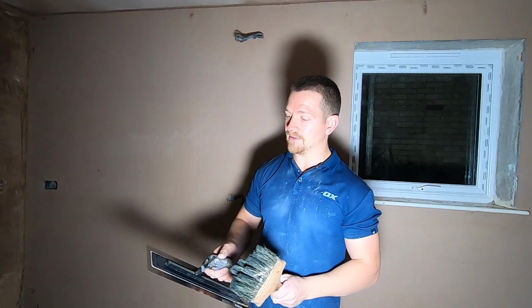Next we're going to whip out the Superflex trowel, and I'm going to show you a wet trowel. That's the penultimate stage of plastering. Okay, second last stage plastering. It's going to be the wet trowel, and this is where you whip out your flexi trowel. If you've got one, highly recommend you do. This is when you start to use it.